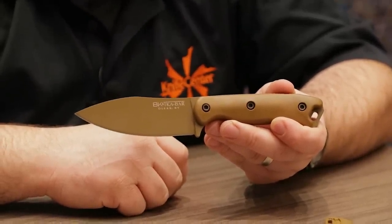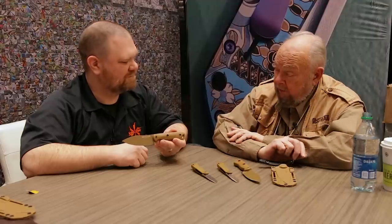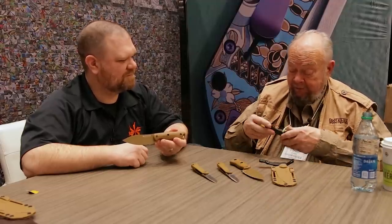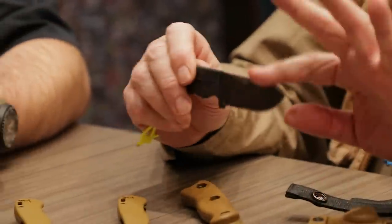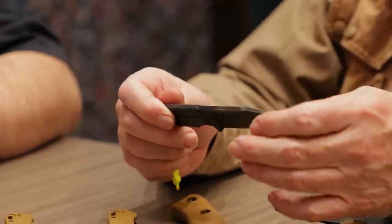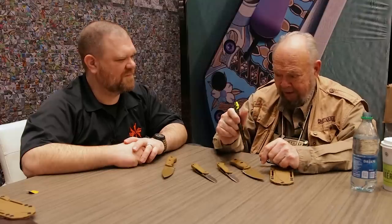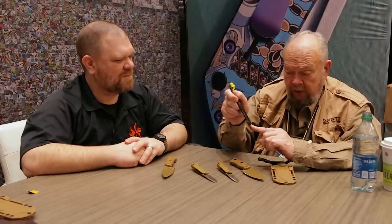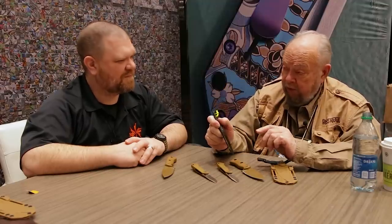And with Crovan, that little bit of extra chromium and vanadium makes a heck of a difference. I think I told you, I haven't done any destructive testing on this one yet, but not this particular knife, one of its brothers or sisters, I drove into end grain white oak to where it just wouldn't pop out. And when I bent it, we got over 45 degrees of flex before failure.